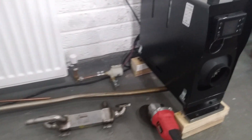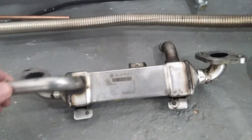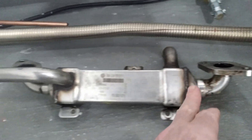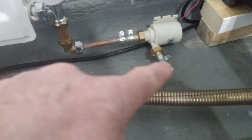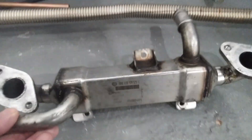We're messing with the heater again in the garage, still trying to make use of the heat from the exhaust. I just had delivered a Ford Galaxy heat exchanger, bought off eBay for £15 - it's a really well-made little piece of kit. We're going to splice this into the exhaust, cut it in so the exhaust comes in one end and out the other, with the two water pipes attached to the radiator, to heat the water quicker.